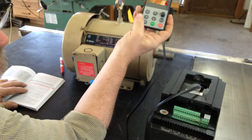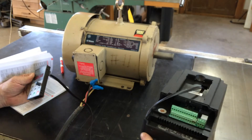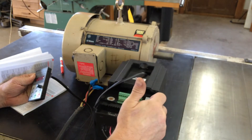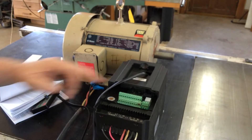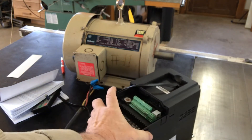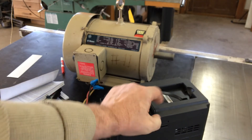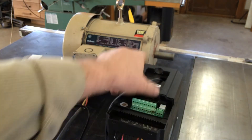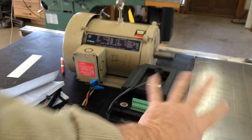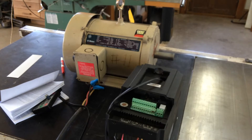I'm not sure what you would need 600 for, but there might be applications. The drive also has another jack right here — you can see there's a little knockout right there, and there's another jack just like that one. This drive can master another drive, so any communications would be transferred to the other drive and they could work in unison. That would be good for planers.